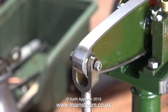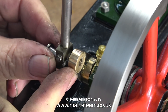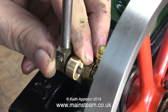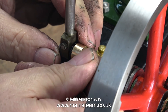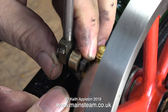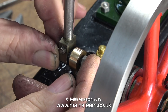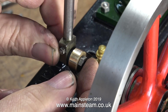Some of the fits between parts on this engine are not brilliant. I machined the crank web so I know that the fit between the crank pin and the crank web is going to be okay. I didn't make the crank pin, and this has a spacer washer which is quite a good idea to centralize the big end. The crank pin is held to the crank web just by this nut. It took me quite a long time to get this nut to engage with the thread on the crank pin, and finally it did, so now I can tighten it up with a spanner.